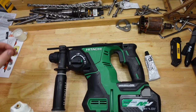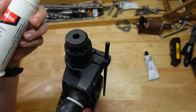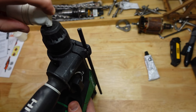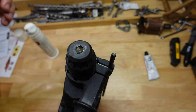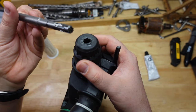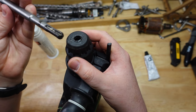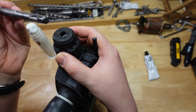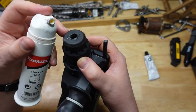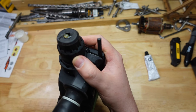How much grease should you give it? When I get a new rotary hammer, I'll usually give it a pump of grease into the chuck, and when you install the bit it just gets squished in there. You generally don't want to over-grease anything, but in this case the grease heats up and falls out pretty quickly, so don't worry too much. Then every five or ten days of use, I'll give it maybe a half a pump — just a little bit.